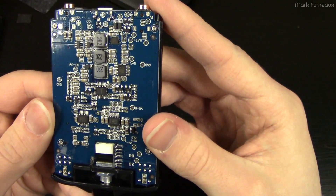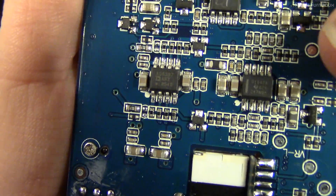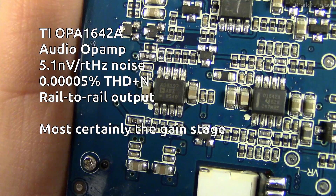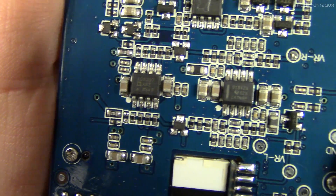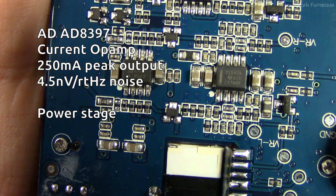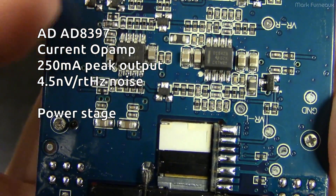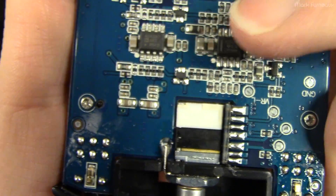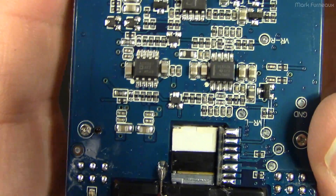Let's take a look at this side — I can kind of read the part numbers on the camera viewfinder. This one looks to be a TI OPA1642A, which if my memory serves me correctly is a high precision JFET op-amp. The one on the other side is an Analog Devices AD8397, which is another op-amp — I've seen that part number before. I suspect one is doing the current amplification and one is doing the voltage amplification. Since the OPA1642A is a JFET input, I think that's the voltage stage and the AD8397 would be the current amplification. So they are doing a two-stage system here.